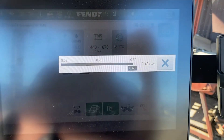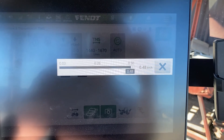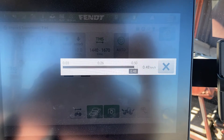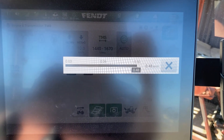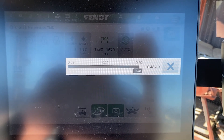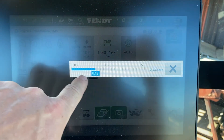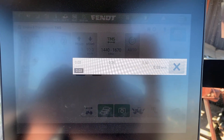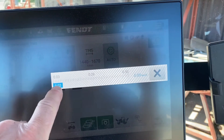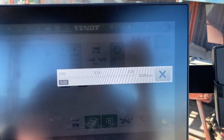Last, we have this one here — when you push it, it brings up a speed. Basically, when you're down in shift one you have the ability to customize that. In the older tractors you used to have to go into the main screen to adjust this, but this one puts it out front where it's easy for you. You can put your finger on that and slow it down so that every time you push the joystick forward you go 0.03 of a kilometer an hour faster, up to just over half a kilometer an hour at the top.